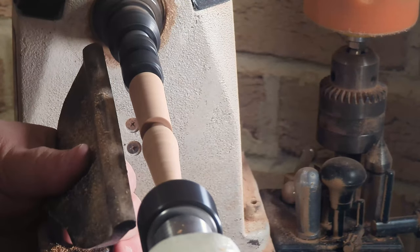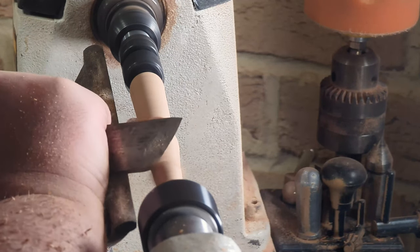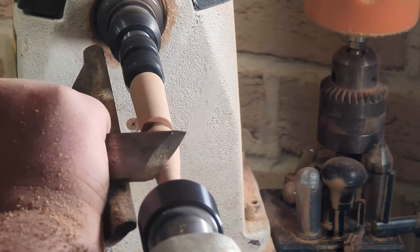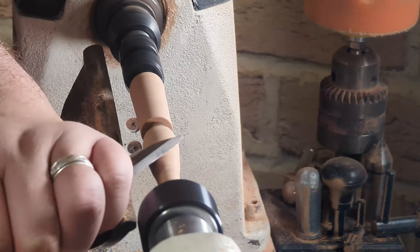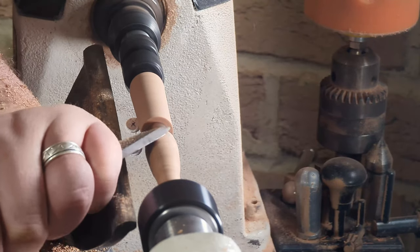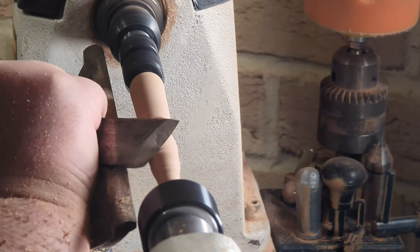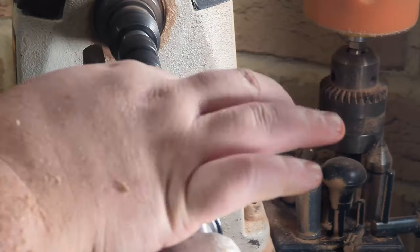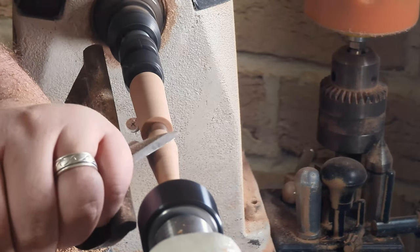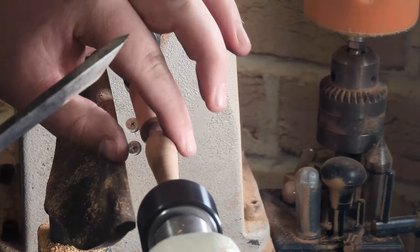You'll notice here I will now dip my tool rest a tiny little bit — that was maybe half a centimetre. I just noticed I was getting a little too high on the skew, or more to the point the skew was getting a little too high and it was about to start passing over the top. So I dipped it a little bit so that I could get back in and have some clean cuts. This was also part of my strategy of not going too aggressive, keeping the tool high-ish to try and not allow myself to go too aggressive.